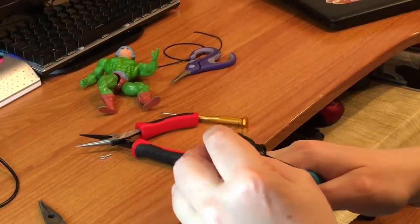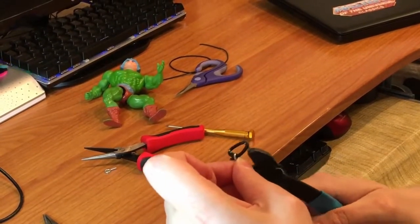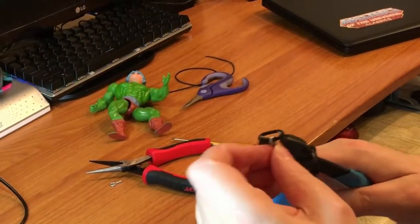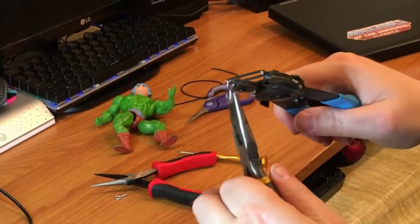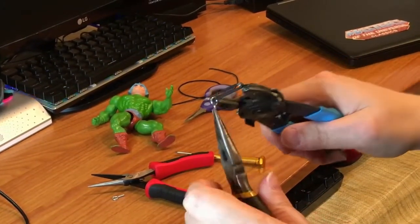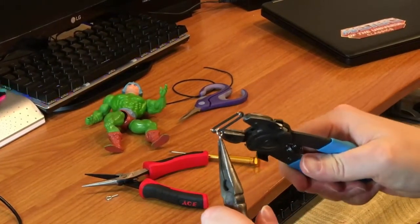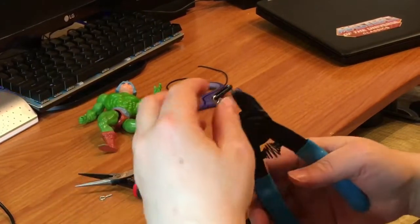We're going to stretch this O-ring pretty far to get from one leg to the other. So we want to make sure that it's easily stretchable and it is warmed up. I find also sometimes the retainer ring pliers is not far enough, so I'll use some needle nose pliers and give an extra pull just to make sure I got that O-ring stretched out and that it's nice and loosened up so that when we pull it through, we're not going to have any issues at all.